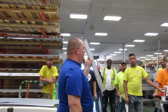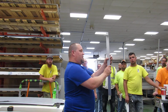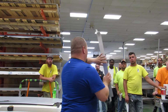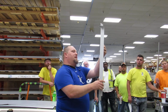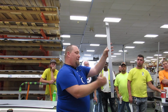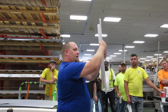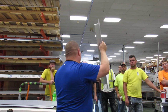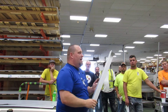The problem we had with that is if anything's off a little bit or if this rocks, it's turning it or kicking them out, because that caulking's sitting right in this corner where you got to try to get it tight. And what happened out there actually a couple times is we had it in there, and either just after it got screwed in, it twisted a little bit, and it basically made the opening dive in the front. And at that point, once that silicone or urethane sets up, you're done. You got to peel the whole thing off because there's no moving it back in.